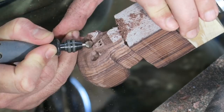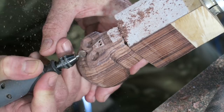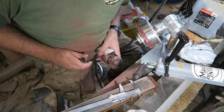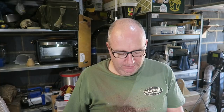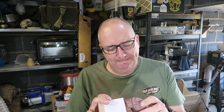Just take your time so you're not over-cutting. It's the one advantage of a hard wood — you don't over-cut it quite so easily, and you'll get a fantastic finish because it is rock hard. Working on the orbits where the eyes go — the eye sockets. You can see I've got my respirator on; some of the wood dust from these rosewoods particularly can be quite irritating and very fine. I'm using my flex shaft on the Dremel, and this wood is very, very hard — it's just chipping the edges on my carving tools, so I switched to power carving.